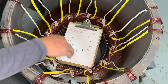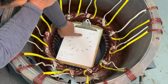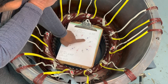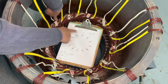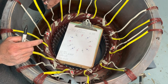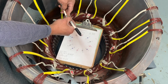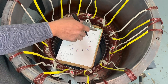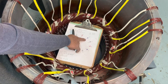Phase one is done — we're moving to phase two for line two. The next coil adjacent to line one's red coil is your line two. For line two, your start is number five and the end — the yellow sleeving — is your number two. I'm following the factory connection so there are no problems.